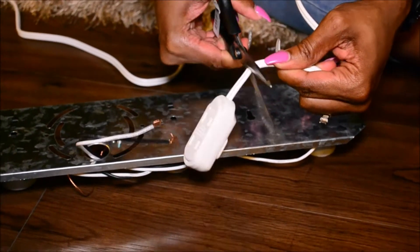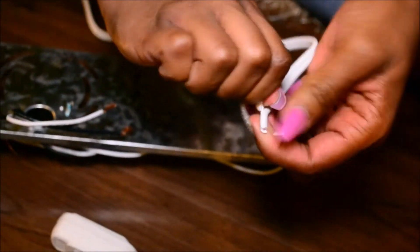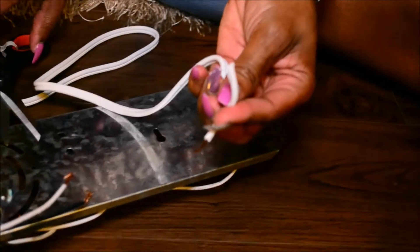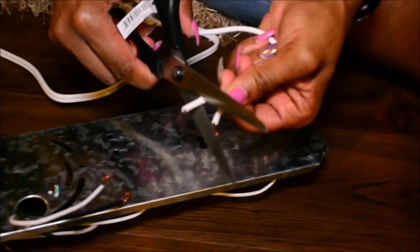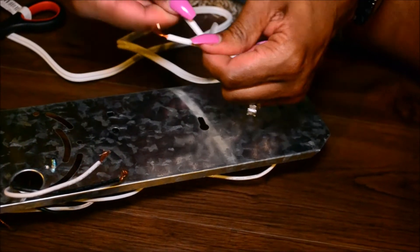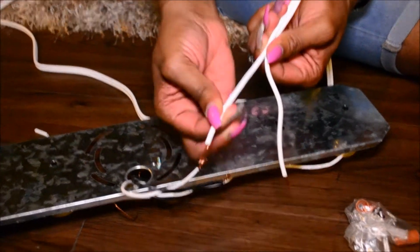You want to take your indoor electrical cord and cut that off just like that. Now split down the middle of the cord with some scissors and just pull it apart, because we're going to use that to connect the lighting. Slightly cut through the plastic about an inch down just like that, being careful not to cut through the wires inside because you do need that part. Repeat that step one more time for the opposite cord.